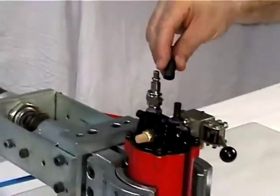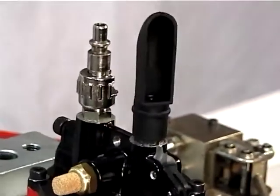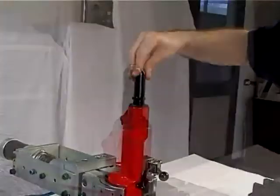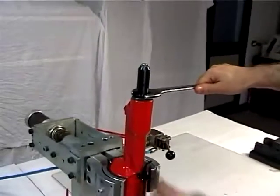After cutting the air feed, remount the reduction, figure 21, and the guard, figure 12. Check that the nozzle and the head carrying nozzle, figure 1, are not damaged. Then mount the head carrying nozzle, tighten it with a 27 mm wrench.